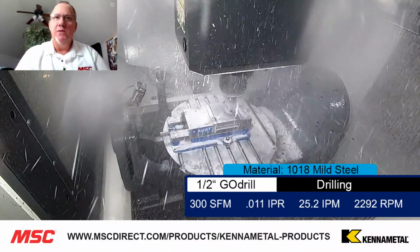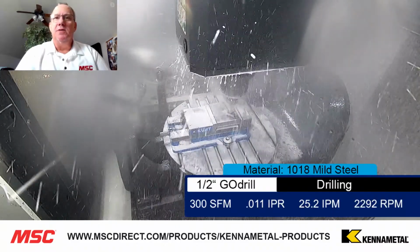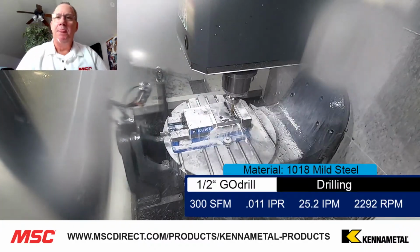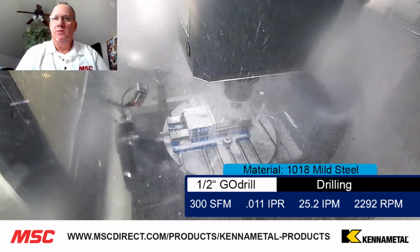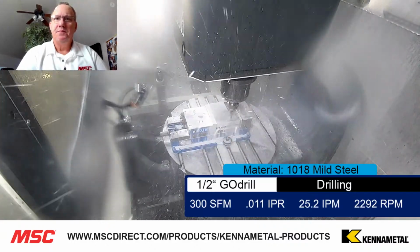But you can see here as we move to the GOdrill, we're getting great chip control. It's got a marginless design, so it helps reduce friction and heat, which actually increases tool life. So we can see here we've got much better chip management with this particular GOdrill, running it quite a bit faster, 300 surface footage, 11 thousandths per rev.